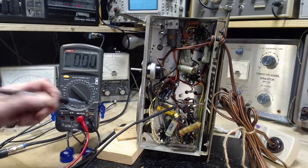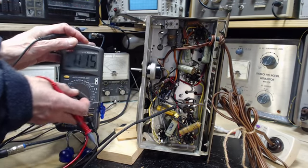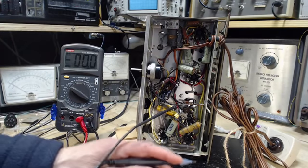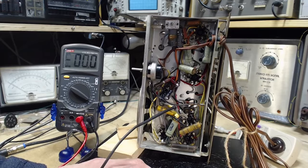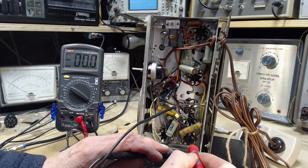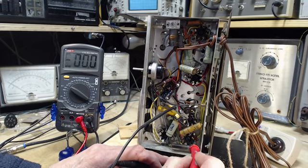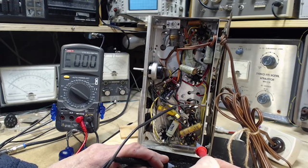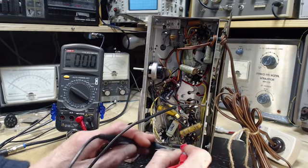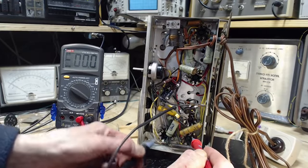20 volts AC, and we're looking for higher than that. We're looking for something like 35 on the 50L6. I wonder if that's what would... No, that wouldn't necessarily happen. Stop wondering and start measuring. So, pin 2 and pin... Why don't we just take the voltage drop right on this resistor right off the bat? How much voltage is it stealing from the other tubes?